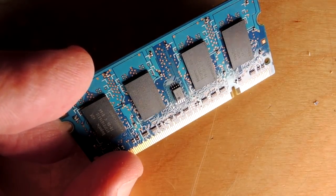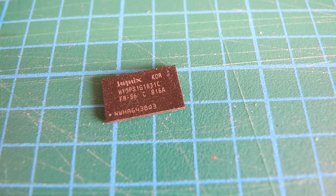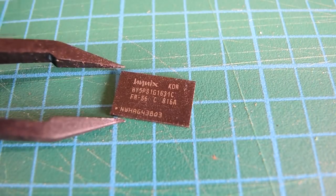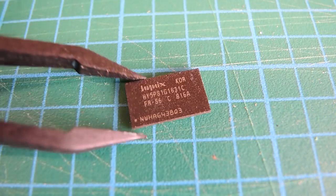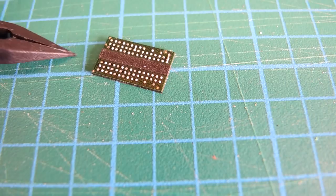The first things we note is there's obviously the DRAM package providing the storage, and then there's a semiconductor in the middle I'll get to in a second. Here's one of the DRAMs I desoldered from that DIMM — it's in a package called a Ball Grid Array. If we flip it over, you can see why it gets its name: the actual connections are little solder balls arranged in an inner grid.